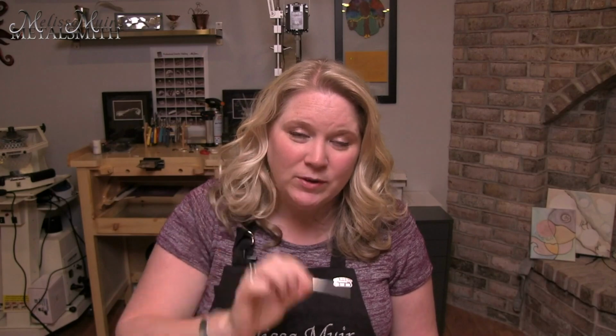Well, really you just need to have some half round stock. And quite honestly, you could probably even do it with some square stock and not even go with the half round. But in this video, I'm going to use some wire that is already half round. It's 4mm wide by about 2mm tall. And you can order this. This would look like 6 gauge if you're ordering here in the States. So 4mm by 2mm, and that's what we are going to be starting with.